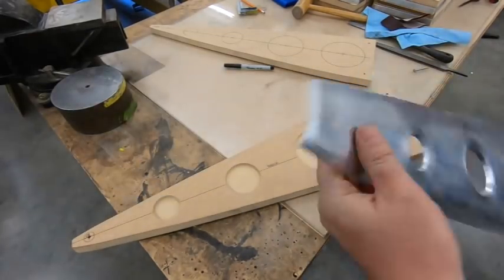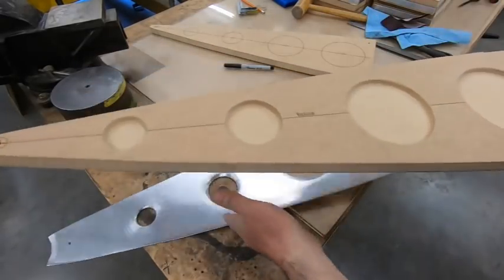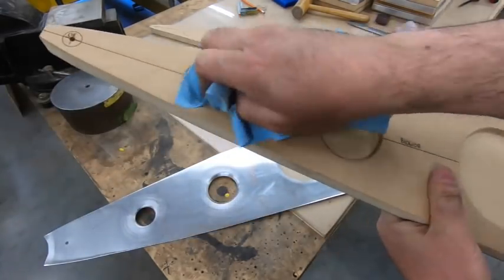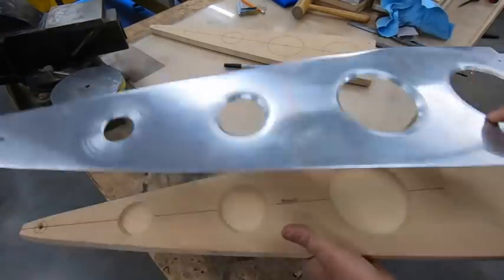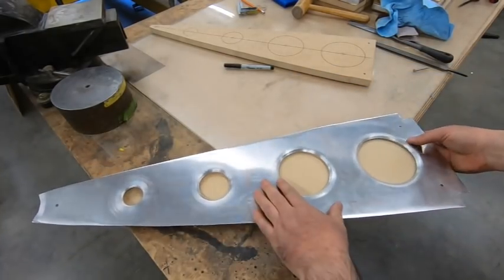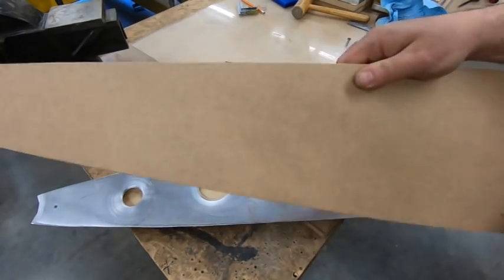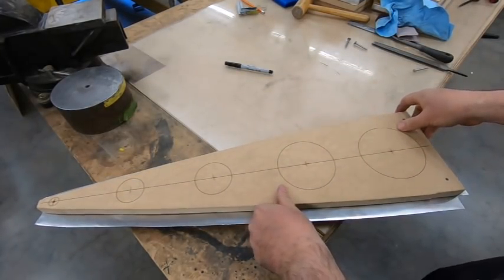With the critical areas now deburred, it's time to put them on our form block. Not necessarily a good idea to do all your filing and deburring over top of your form block — it's the same as with the press and the lightning hole dies. You want to make sure that there is nothing stuck between the mating surfaces that will get embedded into the Alclad on the material when the forming assembly is put together. Same thing with the backing block mating face — it's got to be nice and clean. A little bit of dust is okay, but you don't want any flakes of metal.